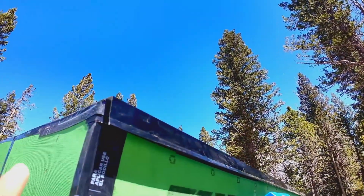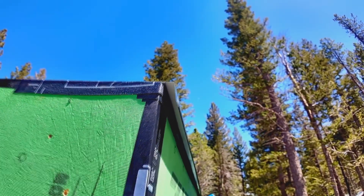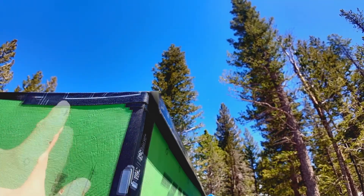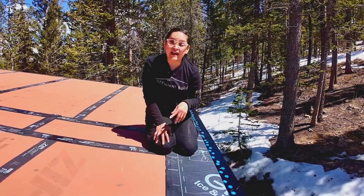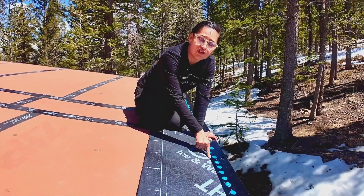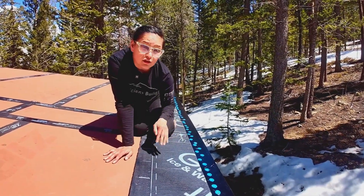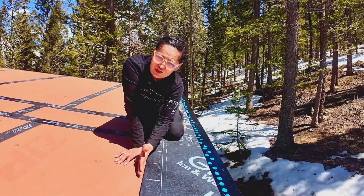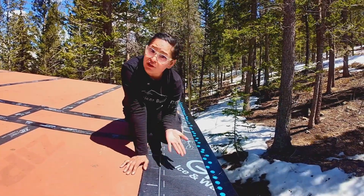We've now installed the drip edge. You might notice there's a gap of about an inch — that's on purpose. First, we haven't installed the soffit fascia yet. Second, it's very important to leave a gap so that any water running off the roof doesn't climb back up through the drip edge due to surface tension. There is a debate on whether ice and water shield should go under or over the drip edge. The argument for over is that it covers the joint and water cannot get under. The argument for under is that nails are self-sealed, and also if you have a very large ice dam it could go behind the drip edge and back up into the structure. GCP recommends putting it under — but check with your local jurisdiction because it varies.